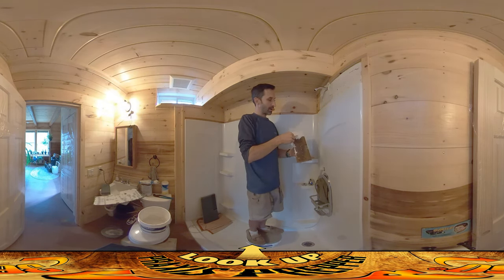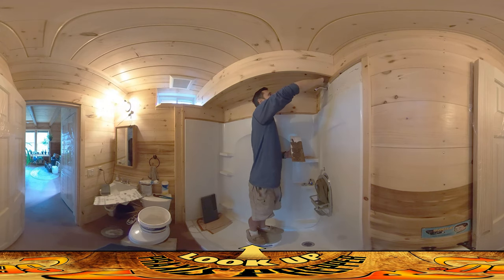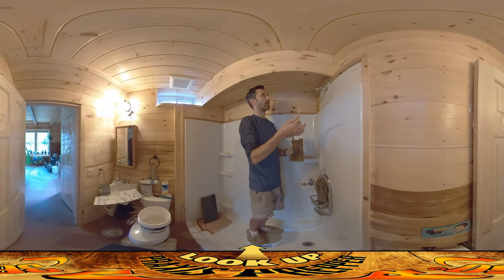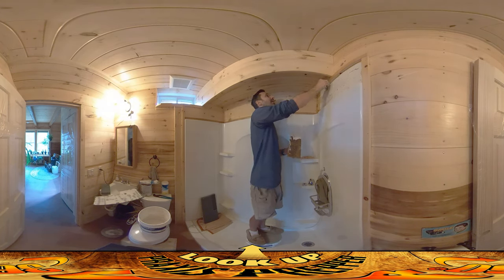So I put these guys together and continue across the whole place — I should be able to get this job pretty easily done today. Then I'm going to let it sit for several days at the very least. Once it has sat and dried, I'll be able to put the grout in and start finishing up the job. After the grout, you've got to wait for the grout to dry, and then you usually put like a tung oil seal on here. So it's a couple of weeks even though I'm finally getting tiles up — it's going to be a couple of weeks of waiting time and drying time before this place is really ready to go.